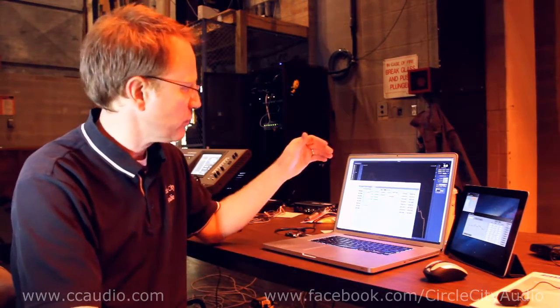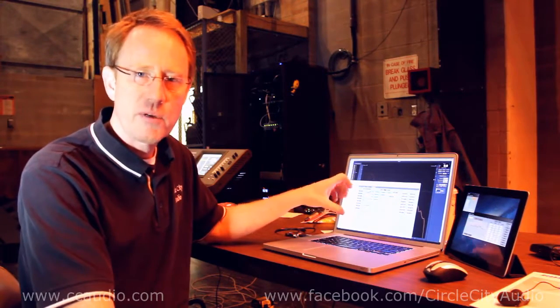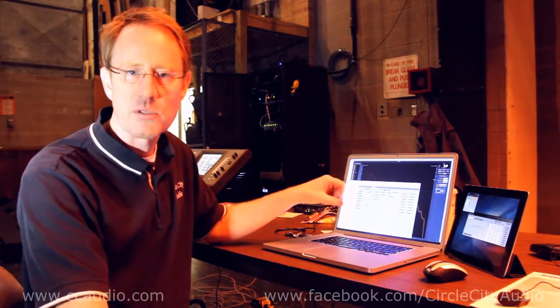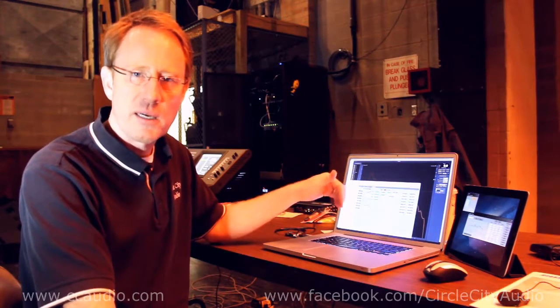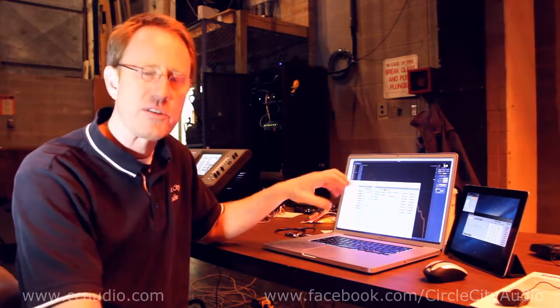We can run the surface up there, but they were very intrigued by the iLive MixPad application for the iPad. So that's something else that we've done, is set them up with a wireless router so they can manage that mixer. On the tail end of that is a ControlSpace, which is a Bose DSP product. We have a couple of analog cards in it to manage input from the iLive and any other things that need to be done over time.